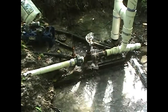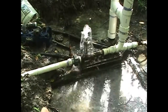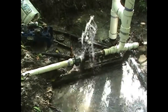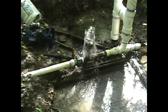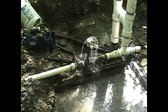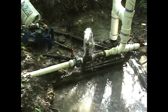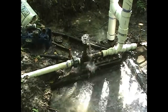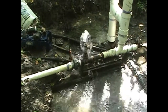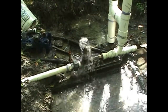This one-inch valve, when it's running, is 128 cycles per minute — significantly higher cycles per minute and obviously significantly less water delivered. But at the end of the day, it's better to deliver some water to your farm than none at all. So I just wanted to point out that these pumps are very scalable. If your ram pump doesn't have enough water supply late in the season, don't get upset — go out and get a smaller impetus valve and you can scale it back and still get some water out of your pump.